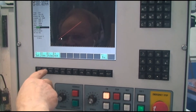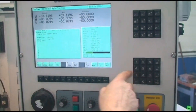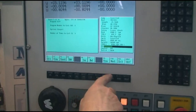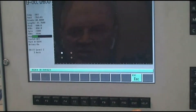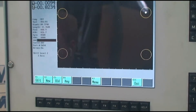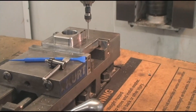Now what I do is I run this program here. I will go with conversational hole 42. Now 42 calls 43, and then 44 and 45, which I'm deleting. So that's all this does — just those four holes, and we just continuously do them. Now I know that nobody really cares about how to program, so I'm not going to go into it in detail. But this is just four hole locations repeated primarily this way.